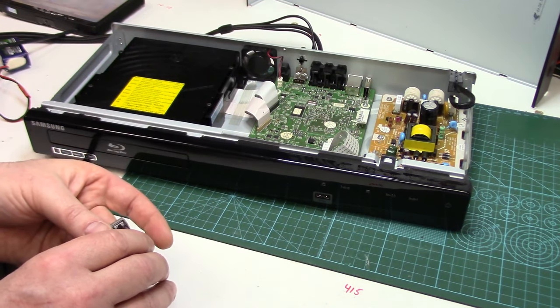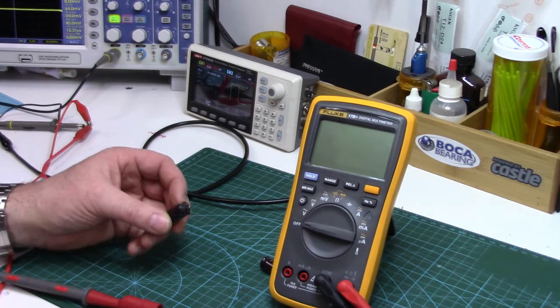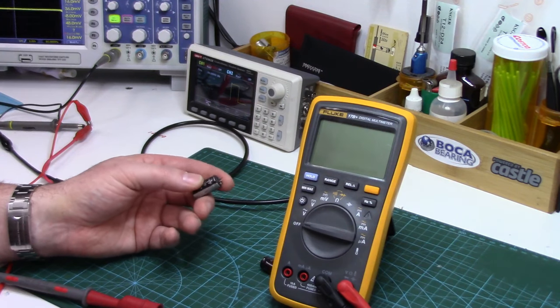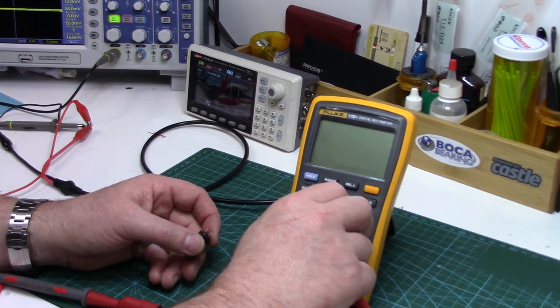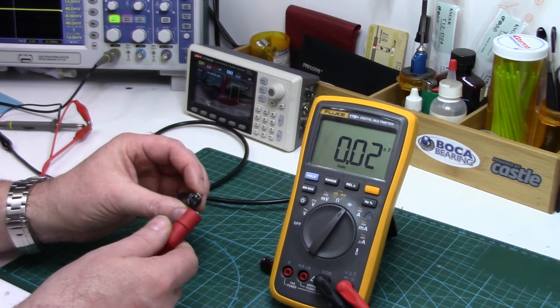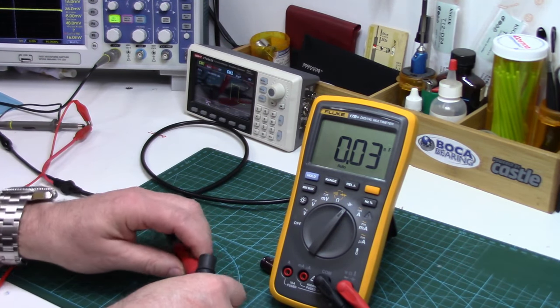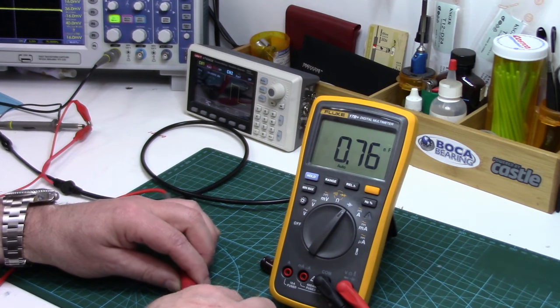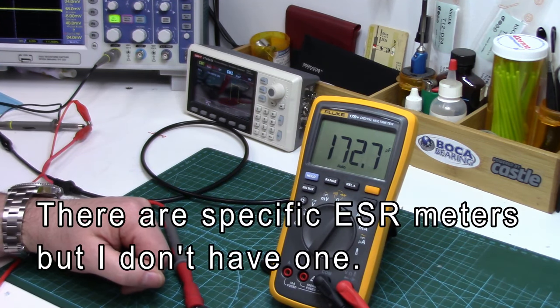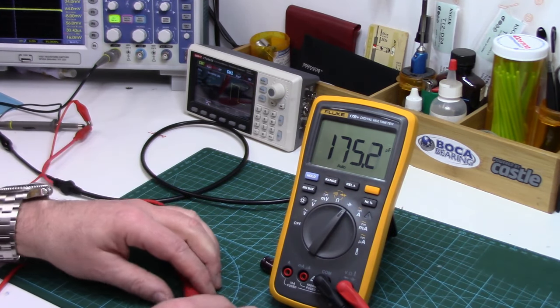But a good 25% don't. I'm going to show you an easy way to check these if you've got an oscilloscope and a function generator. So one way you can try to check electrolytic caps is if you've got a digital multimeter with a capacitance scale on it, you can try it. This isn't really ideal — it doesn't really show if you've got high ESR in your capacitor.